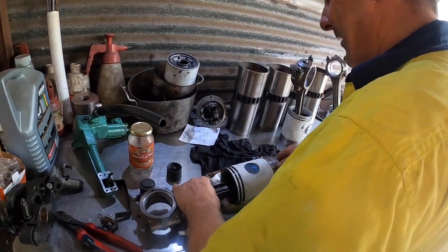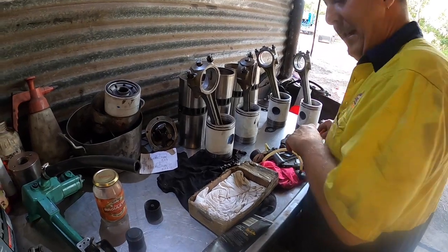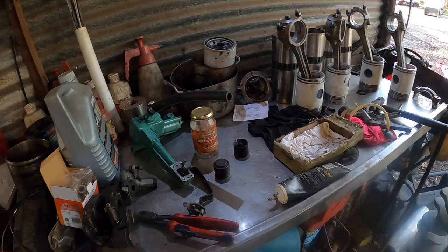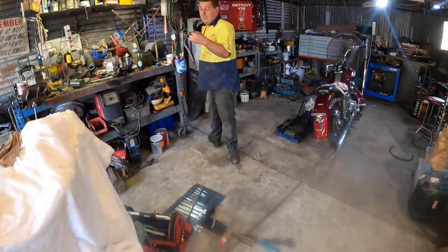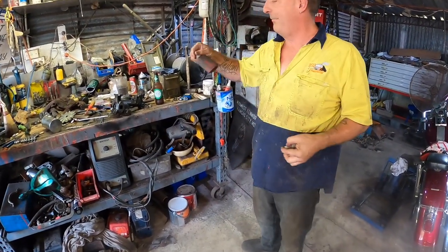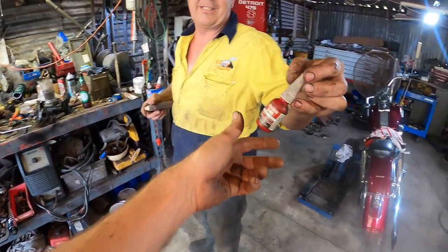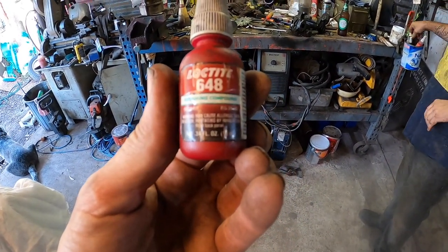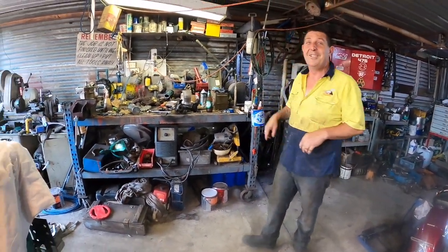Working very nicely. And I don't think I asked you before, the Loctite you put on, it was green Loctite? Medium, green, is it? Was, yeah. Where did I put it? I just had it two minutes ago. I'll put it back. Yeah, like a bearing mount. Oh, okay. So 648. That one's wrong, but like that's a bearing mount, a retaining one. Bearing retaining mount compound, yeah. Press fit, yep. So it'll hold things in there where it should.